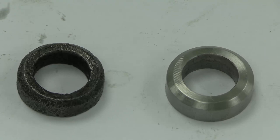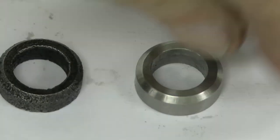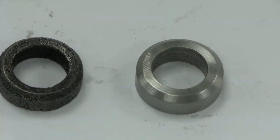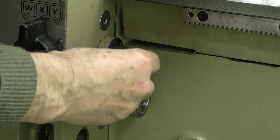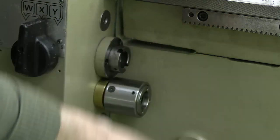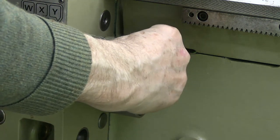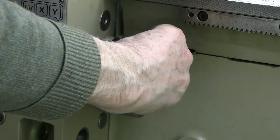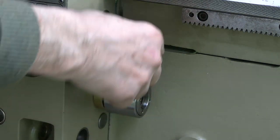This bush which sits inside the torque-limiting clutch is obviously totally rusted, so I made another one out of 316. It turned out 0.2mm thicker, and that'll just have to do because it's difficult to put it back in the chuck to skim and face that off. I'm not totally sure whether it goes in with the chamfer on the outside or the other way. My reasoning is — and I can't tell from the parts diagram — that the chamfer that way would be pointless. So I'm going to do it like that.